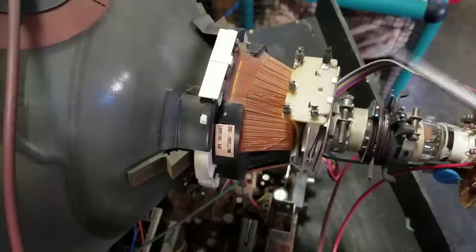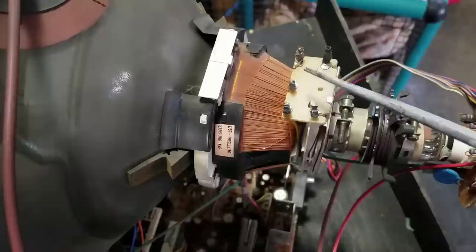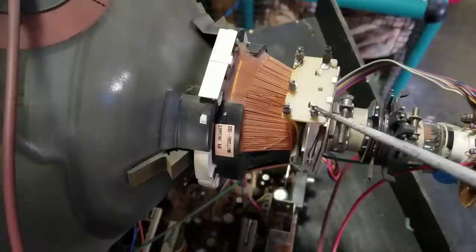Unfortunately, a lot of times you have to do that while the CRT is running, so do be mindful of these points on the back of the plastic. On CRTs like this — standard televisions — these are usually exposed and can be shock points. Do not tap into these points; there is current going there and if you ground it out there you could shock something.